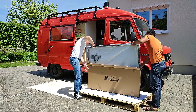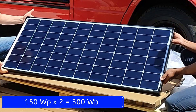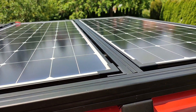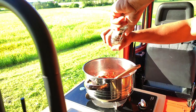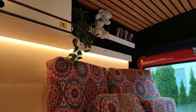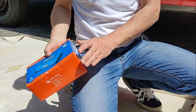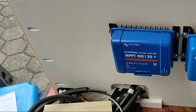The setup of our solar system consists of two solar panels from Tiger Expert with 150 watts each, giving us a total of 300 watts. They are extremely efficient with 24% energy conversion efficiency and have a very suitable length of 131cm, so I can mount them in a transverse position on the roof rack or even within it. 300 watts should be plenty of power for our small van, especially as we cook with gas and use electric power primarily for LED lights, the fridge, and charging phones and laptops. Between the solar panels and the battery comes a Victron 100-30 MPPT solar charge controller, which maximizes energy harvest and charges the battery with the correct charge algorithm — that's absolutely essential.